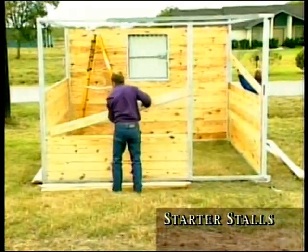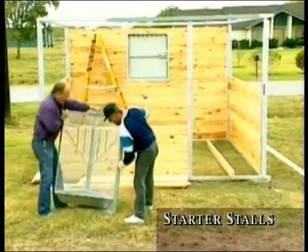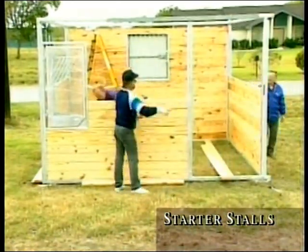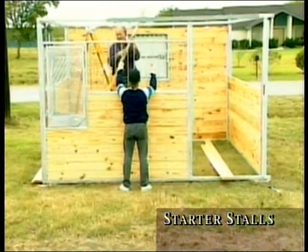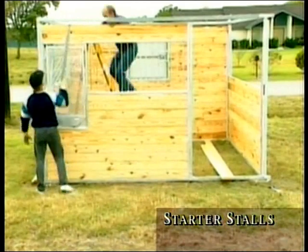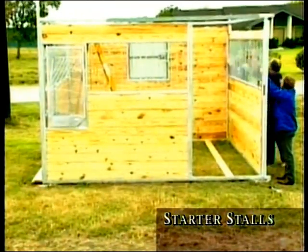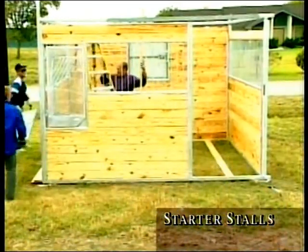As you can see, we've loaded six boards into the front section to accommodate a swing-out feeder, then four more boards for our grill. After installing the grill, add two more boards and two hold-downs, locking everything in place. Next, place the grills into your side or dividing walls, and again, place two more boards above each grill, holding them in place. Add two hold-downs to each, and you have now completed your 8-foot walls.